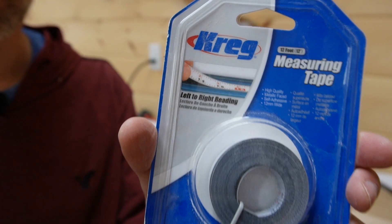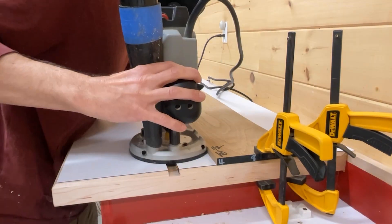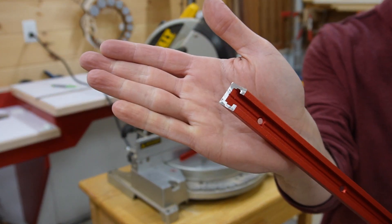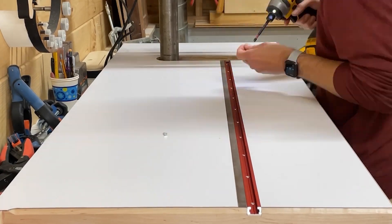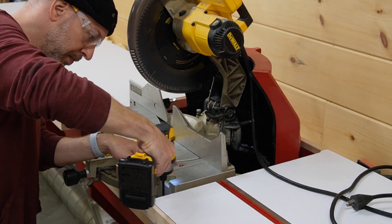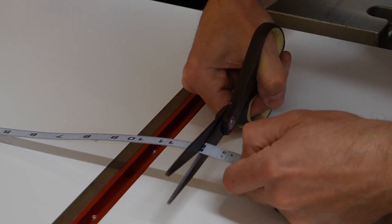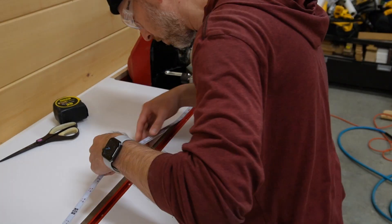Then I set up to make shallow grooves for the measuring tapes. I set the bit depth in the exact same way and then route the grooves. The T-track is made of aluminum, so it can be cut to length using woodworking blades. I miter one end to match the chamfer on the edge of the miter station and then screw the track in place. To precisely attach the measuring tapes, I first set the miter saw in place and secure it with a few screws, then take a measurement from the tip of the blade's teeth to the edge of the table. I cut the tape to that measurement using a pair of scissors, remove the sticky back tape, and install it.